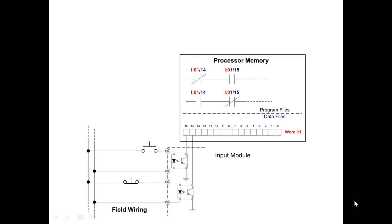Well, we've made a few changes here. Let's fatten up our diagram with more than one input and change the device to momentary contact push buttons. We did have a normally open pressure switch in there. Now we have a normally closed and a normally open push button. There are two push buttons in this diagram. What is the difference between the two?